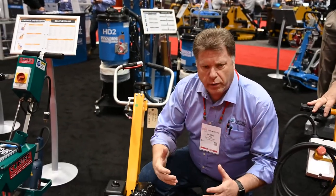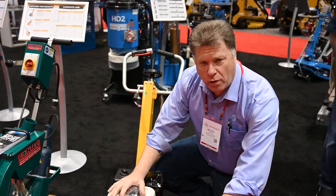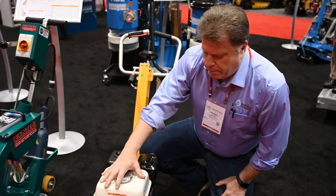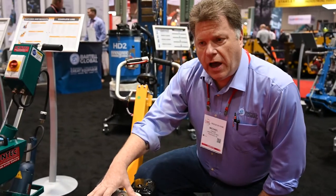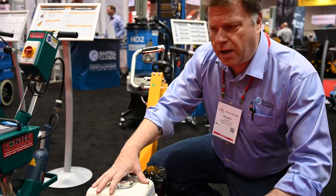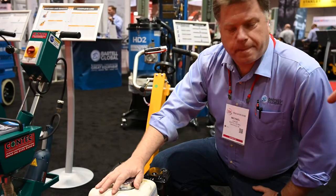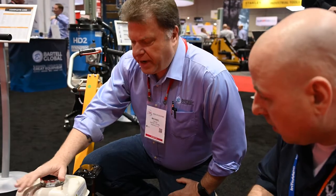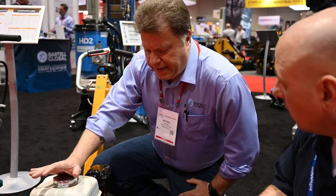Knowing what kind of profile you need for a floor — guys will use a scarifier anytime they need to profile. They can remove or they can grind with it. This would be used for customers doing overlayments, underlayments, and also removing paint, paint lines, and asphalt. It's very common for unleveled concrete sidewalks because it's quick and easy.